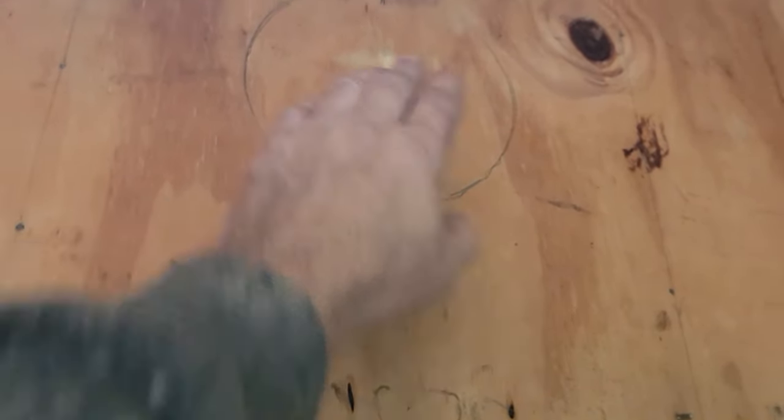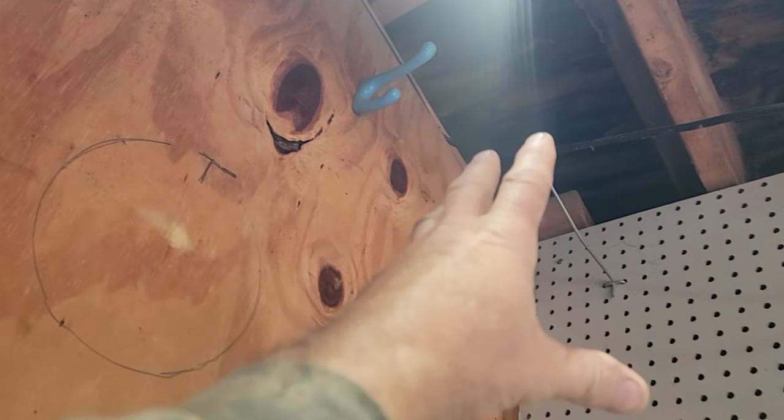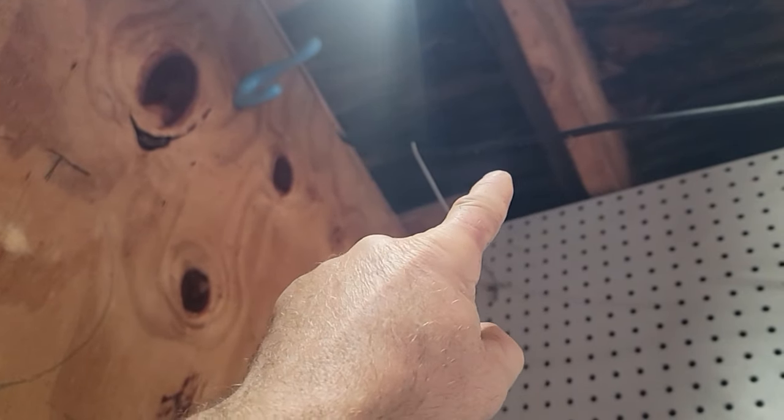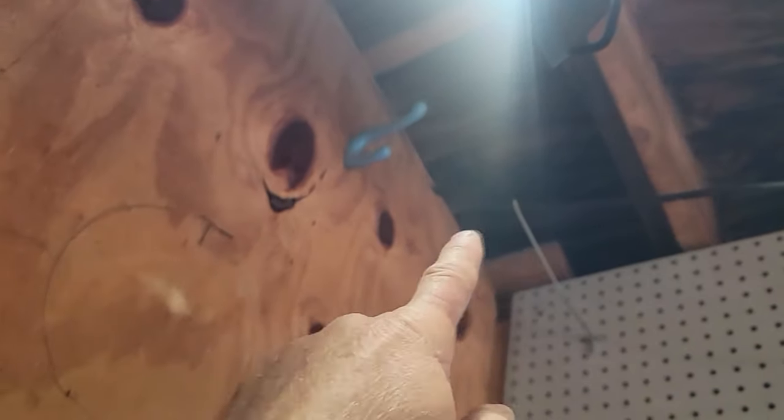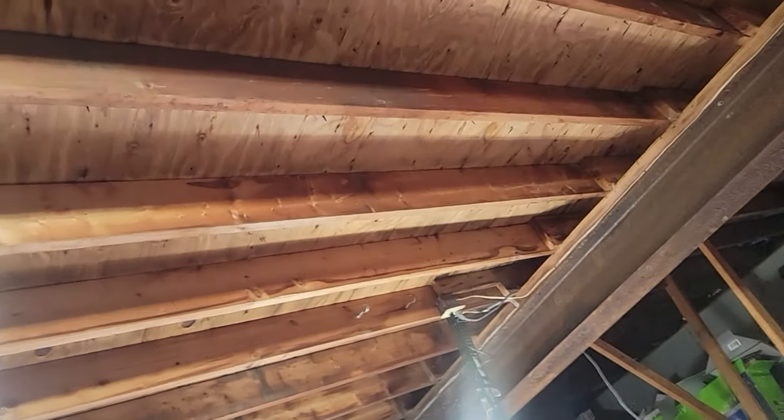I still got height above so it doesn't overheat the ceiling. On the ceiling I want to do insulation — that's two-by-eights, so probably R19, keeping an air gap for venting above it, then drywall. I'm not going to do the whole ceiling right now — just near the wood stove. I may do this wall and four feet on each side, and the ceiling four feet in the area of where the stove is for now. Once I get initial heat in here, that'd be a great project in the winter months to continue and get this all drywalled and insulated.